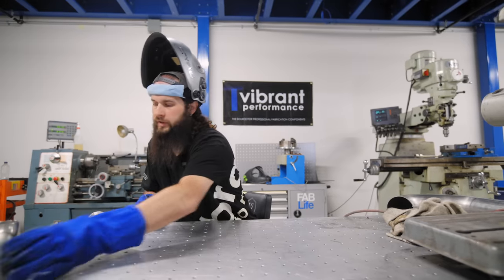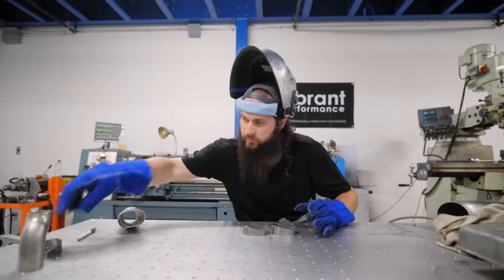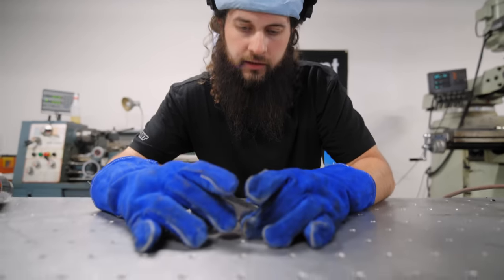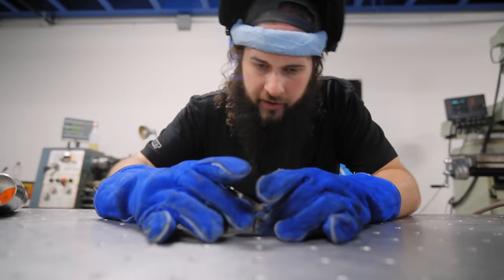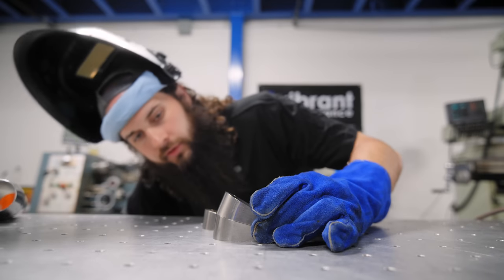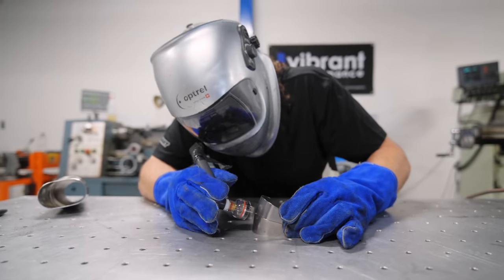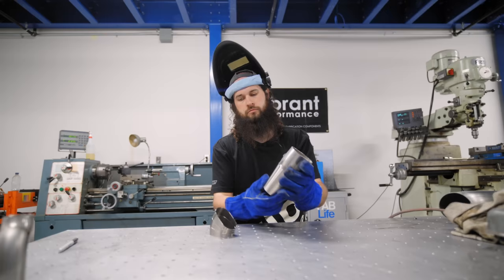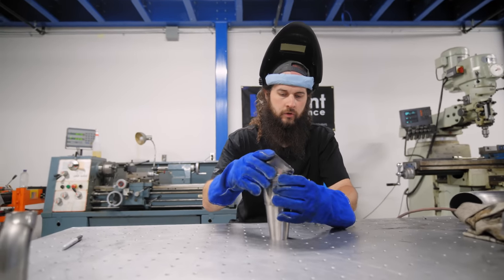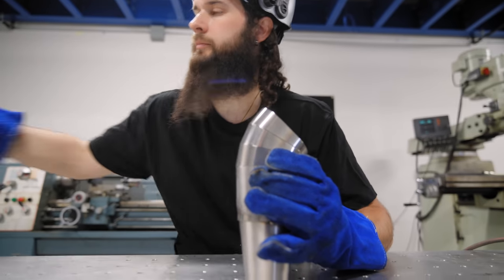We can also tack together our ovals. These are cool, these little ovals. They make that center line radius a lot tighter than the traditional oval mandrel bends. And we are limited for space in the back of this car, so these really come in handy. Doesn't matter what our top is, it's pretty symmetrical. So, put our guy on here. Looks good.